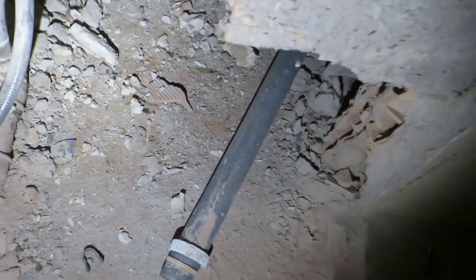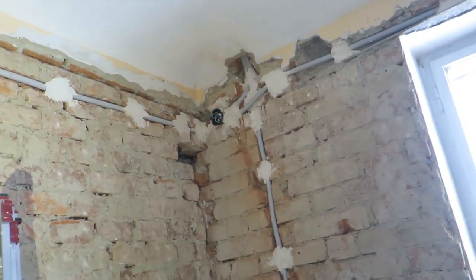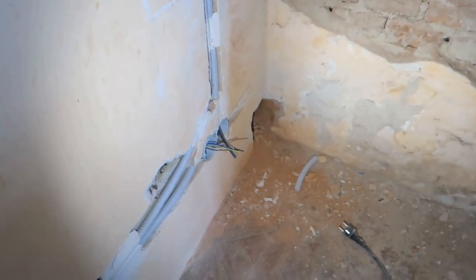Well, anyway, so yeah, I removed the bathtub. That was interesting, because I realized that, wait a second, okay, let's go to the kitchen. This is easy. There will be a few tables, again, some light and a switch. But then I was looking here, and I was like, wait a second. Now, I want the kitchen line to be here. So now there is the oven, so the sink will probably be somewhere here, right? But for the sink I need a waste line. So I was like, okay, there is the bathroom, so let's make it here.